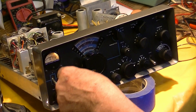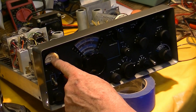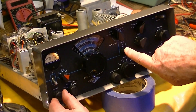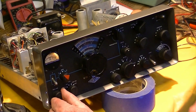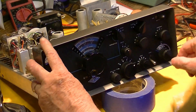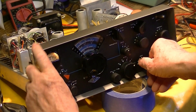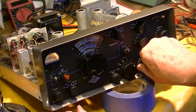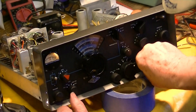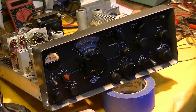When you've got this in the tune mode, what you're going to read here is an oscillator buffer, and you just tune that for max. You're going to set this drive for one on the low bands. So let's go ahead and put it in the transmit mode and we'll tune the grid for maximum on the meter. It should come up — there's a little marked zone here between 2 and 3 mils. Got a peak there — that's all we need.